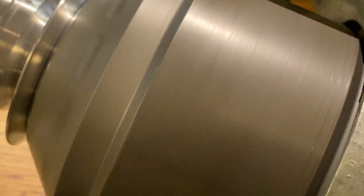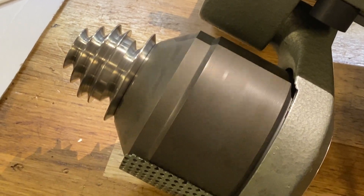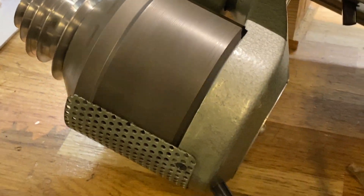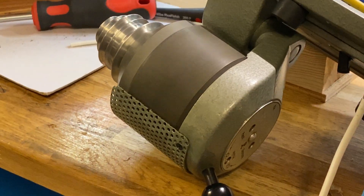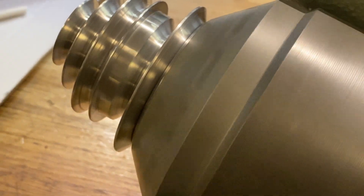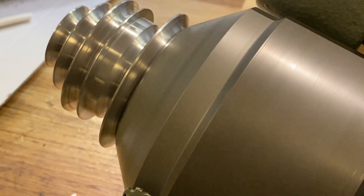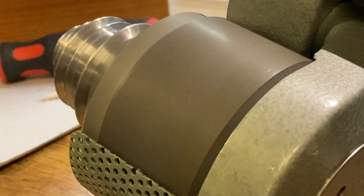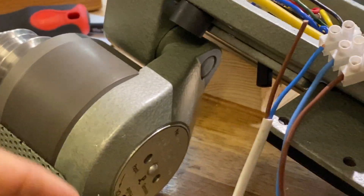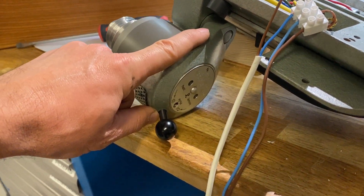The minimum speed on my inverter setup is about 300 to 500 RPMs. This motor is turning about 500 RPMs now, so I'm going to crank it up — I've done this before, no smoke is going to come out. This is something like 300 RPMs running up... this is probably 1500... and this is the nominal maximum RPM of 2700. Running it on three phase, it actually runs a lot smoother than on single phase — you wouldn't think it makes much difference on a 50-watt motor, but it does.